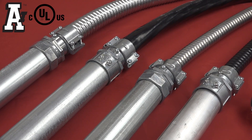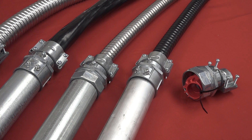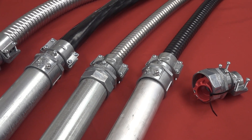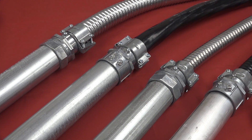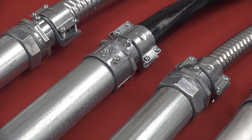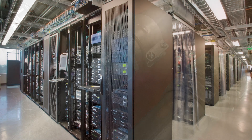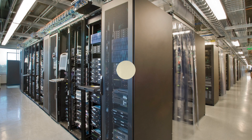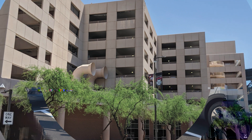Arlington's listed cable stop transition fittings are the efficient, cost-effective way to transition feeder-sized cable and flexible conduits to EMT, IMC, and RMC in protective drops, risers, and feeds. Ideal for data center remote power panel feeds, panels and equipment feeds, and EV chargers in parking garages.